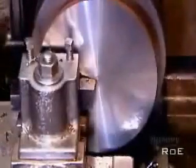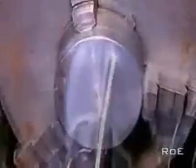They go one at a time onto a lathe. First, the machining tool smooths and evens out the surfaces, getting rid of the marks the saw made. Then it cuts out a small hole in the center of one plate and a larger hole in the center of the other. Next, they cut a smaller and thicker round piece of iron called the core. A reamer bores a large hole through it.